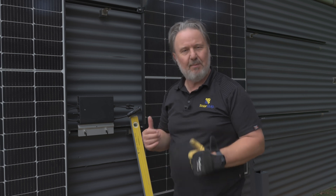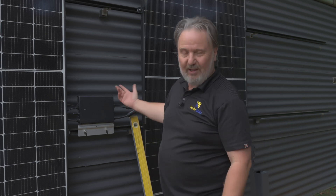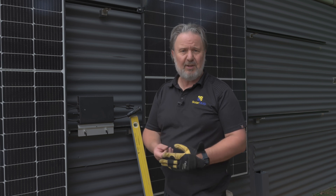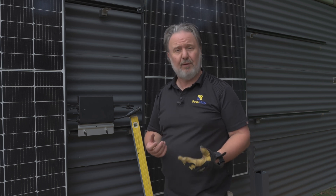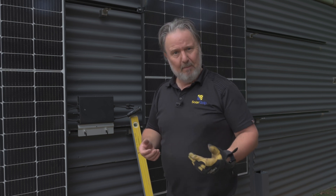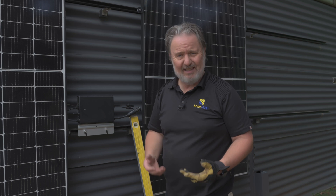It's really important after mounting your panels, whether it's on a roof or on a wall like this, to check you haven't pinched any cables behind the panels themselves. It's one of the other causes of an earth fault — you've compressed the cable and you'll get what's called cold flow of insulation. The insulation actually starts to thin because of compression, eventually crack, and water gets in. Because the modules need to be earthed so that the inverter can detect an earth fault, an earth fault alarm will go off.